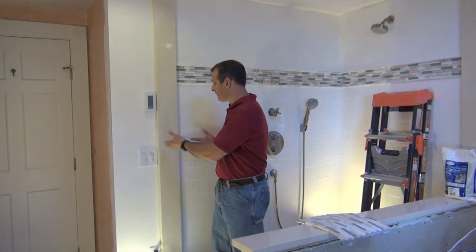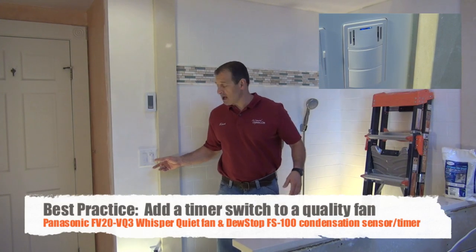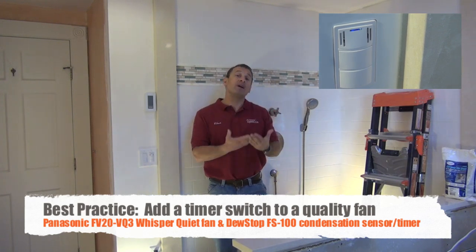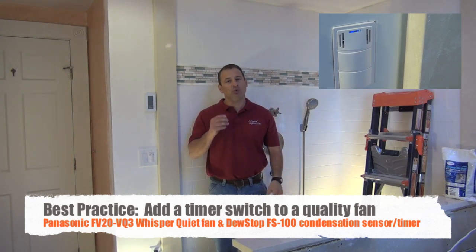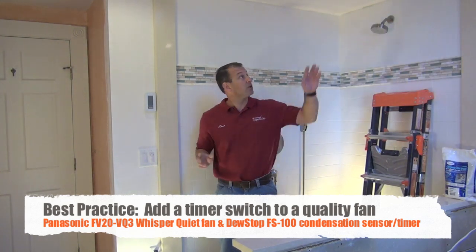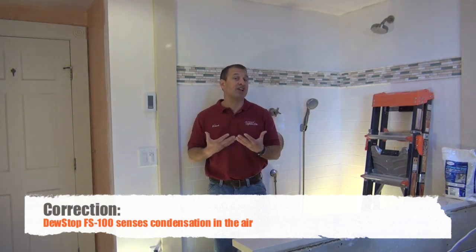While we're on the subject of thermostats, let's talk about switches and timers. This is a timer switch for the shower light and fan. If you press it, it turns on and runs for 30 minutes, and it will stay on if it senses humidity. Panasonic makes these and it goes with the Panasonic fan — it senses humidity in the air and will stay on until the room is clear. Press it again and it'll go off for 30 minutes and turn off.